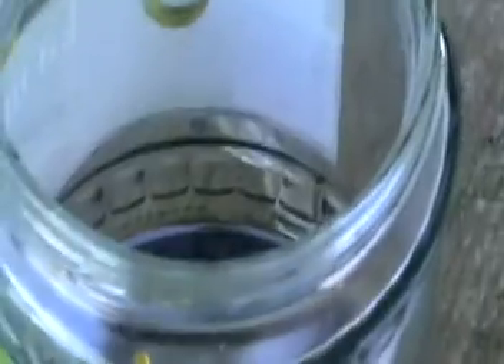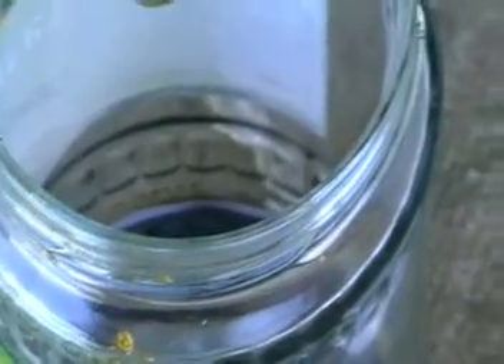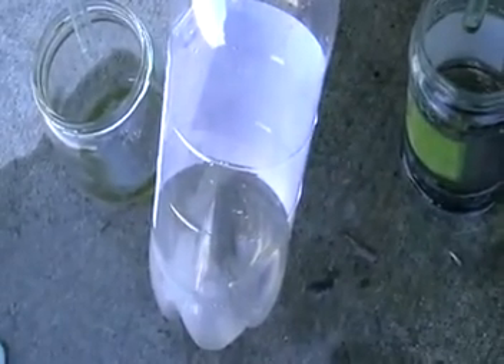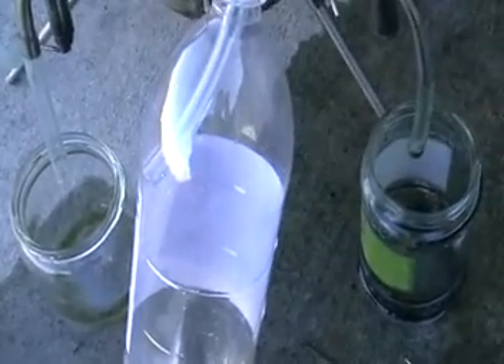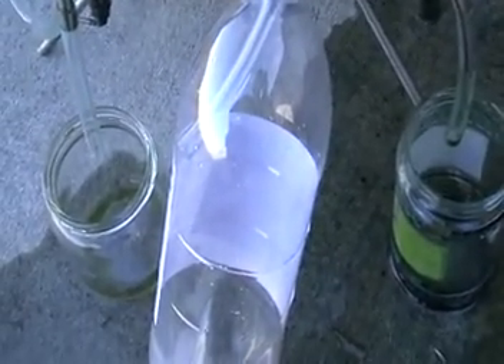This is one of the light fractions. It is not clear because the reformer was used for very heavy oils, very dirty ones — so it is technically residue or tar mixed with fuel. This one is cleaner, and no petrol. To get petrol we have to run it at temperatures over 450 degrees Celsius. We are running it at about 250–300 degrees, just enough to evaporate all the bunker oil.